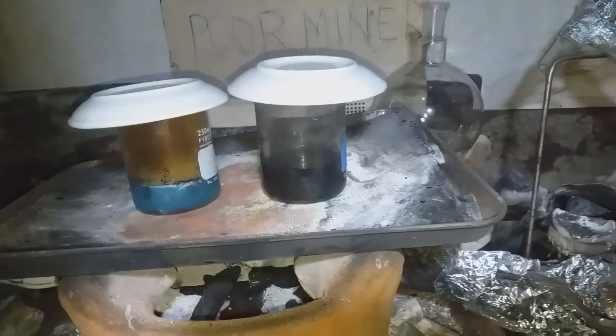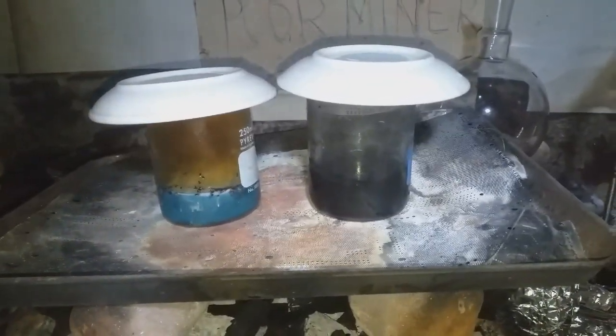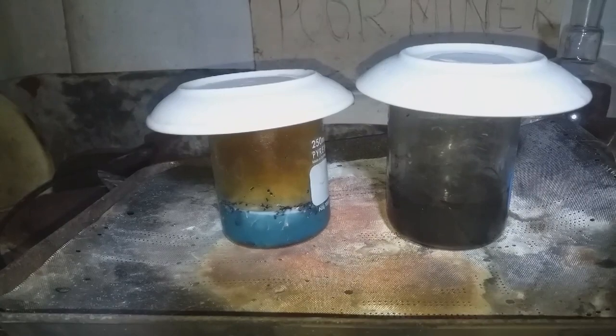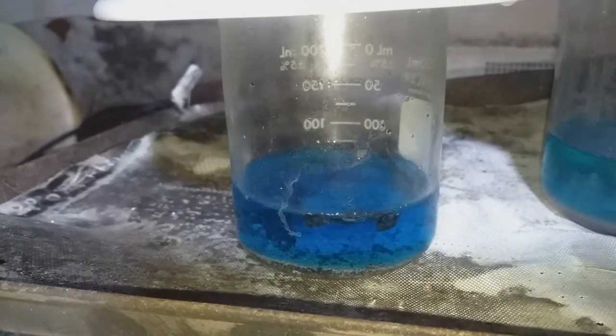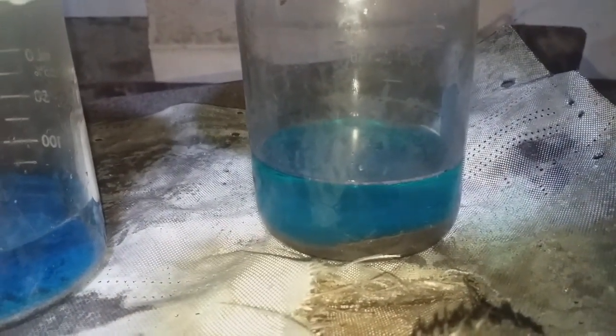After this, we filter and turn to aqua regia together with the gold foil that I had extracted from the collected gold connectors. All base metal is dissolved. This is the plastic connector that I melted and burned, and also the IC chips. Decant this solution, wash with hot water — the gold from the connectors is already on the filter and the board process is almost complete.